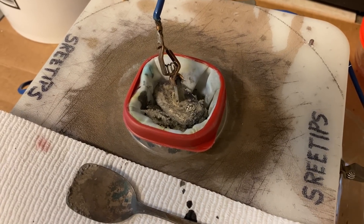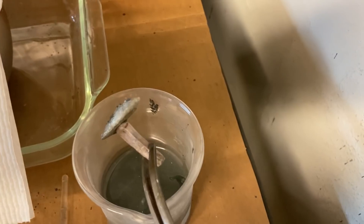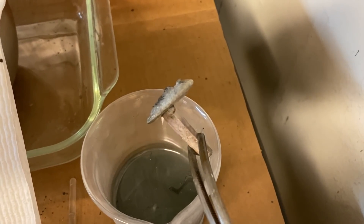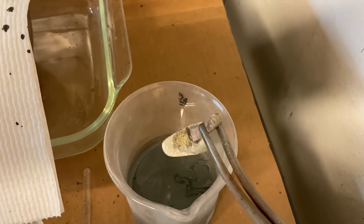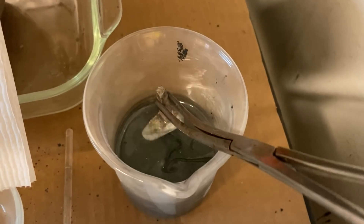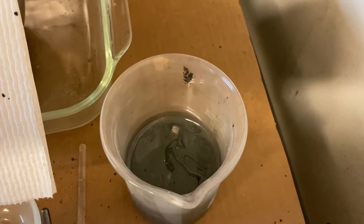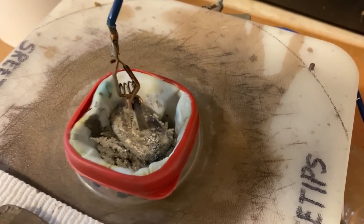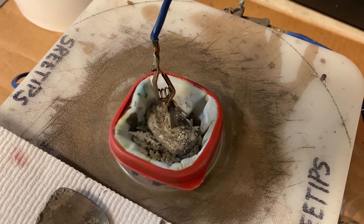This is what happens if we don't keep an eye on our cell. There's the one that got dissolved — see how it's all gone? That was a three troy ounce silver bar with a stem on it. I'll reuse this — I'll pour some more silver in a mold and get it back up to three troy ounces. We needed it that heavy to push the raw silver shot down into the anode basket as the cell operates.